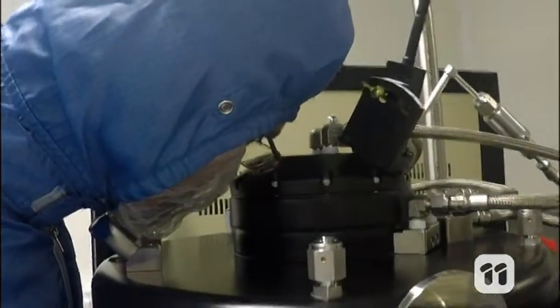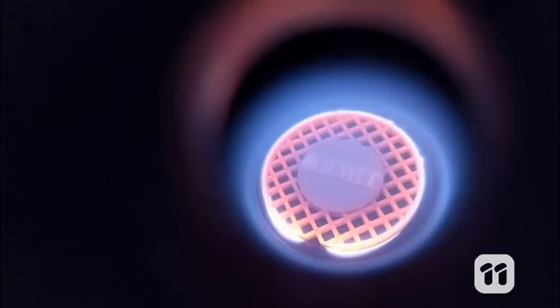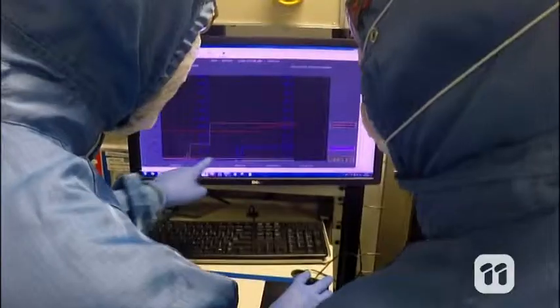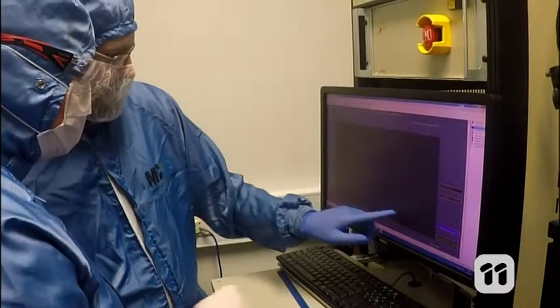This is the cool part. Today we're using a test object instead of an implant. The microwave heats the object and diamond powder under pressure within what looks like a plasma ball. You'll notice that the object gets so hot, it glows. It is under these conditions that the tiny nanodiamonds start to nucleate and grow into a coating.